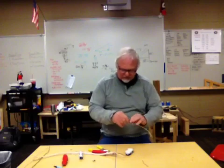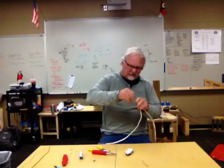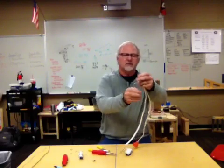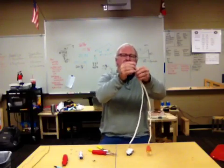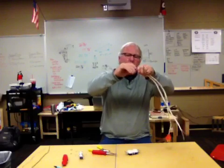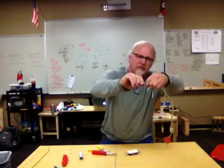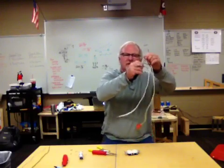So the first thing you're going to do is connect the ground wires to the outlet, okay? And you're going to do that with what we call a pigtail. You'll notice I've put the two ground wires together here, or the two bare wires, the ground wires, which you will learn about in one of the videos too, and this pigtail together. I'm then going to take a wire nut, fit it over all 3 wires. I'm going to wind it down until I feel the wires starting to wrap around themselves. And I know they're tight if I tug on it and it doesn't come loose.